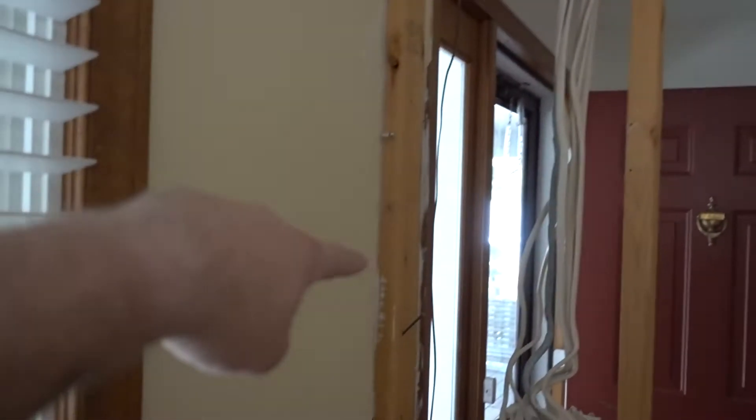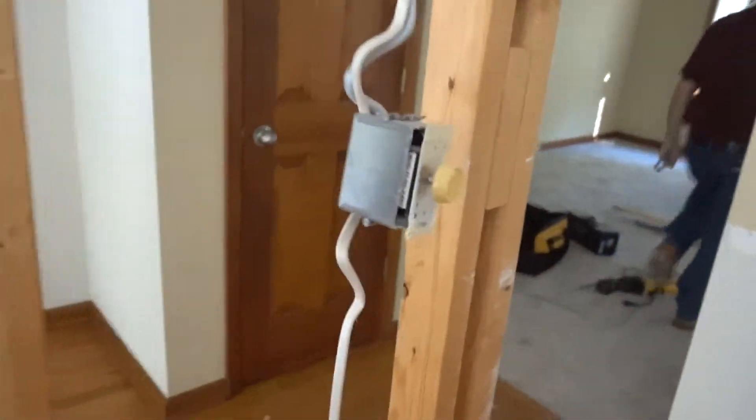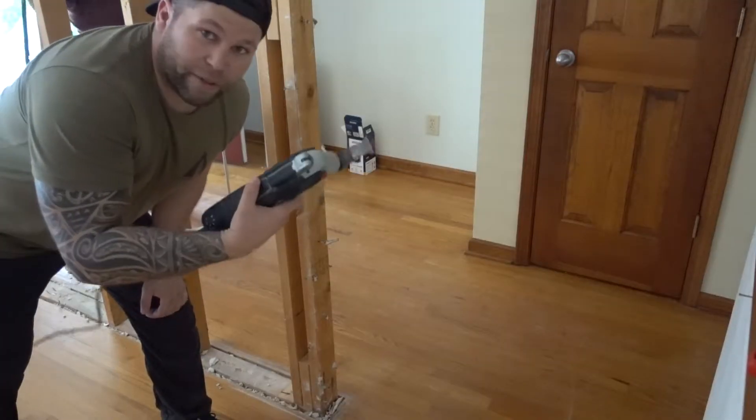All the drywall is done. All of this has to get moved to that wall there, and that is going to get disconnected with a junction box. I have to reroute the light wiring all the way up through the ceiling and reroute all this electrical through the subfloor. Hopefully the wall doesn't come crumbling down when we take this out.